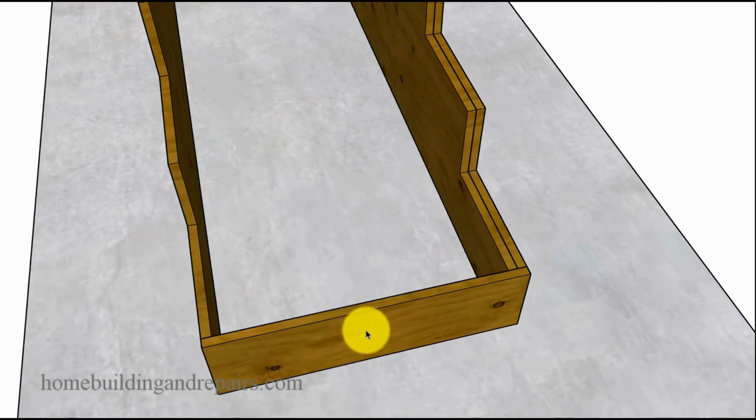So what did I learn from the video? That we might need to allow for air to circulate under and around some of these areas that we can't see and aren't concerning ourselves with. And that lumber that is touching other lumber could actually create problems. We think we're using it to make something stronger, but instead we're allowing an area for moisture to accumulate and accelerate the decomposition process of any wood holding our project together.